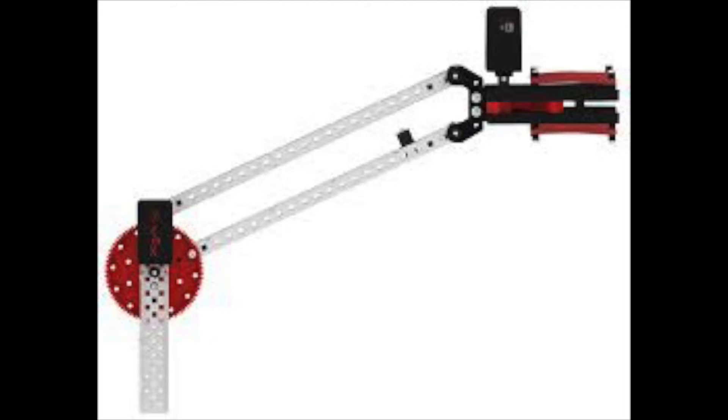Then there's the four bar design. This type of arm uses two stages to have farther reach. The first stage is rotated by a motor, and the second stage keeps its angle relative to the ground, achieving this through chains, pulleys, or linkages.